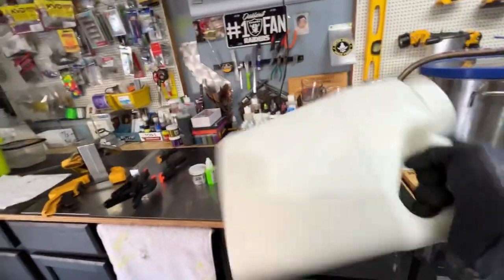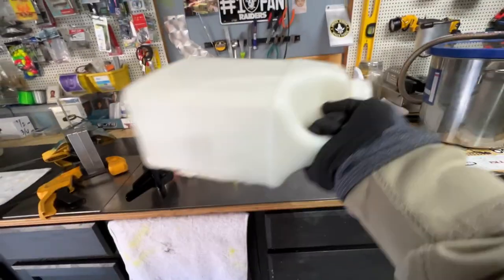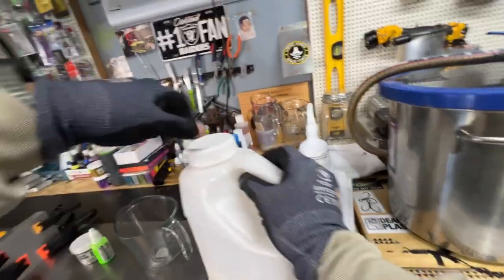My name is Chingy. Today we're going to be making a chartreuse and hologram flake swimbait. First things first, make sure you always mix your Plastisol. If not, the oils will separate in the Plastisol and you'll get a bad cure.